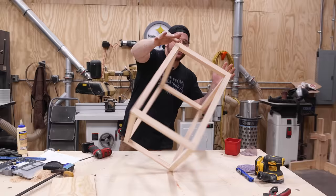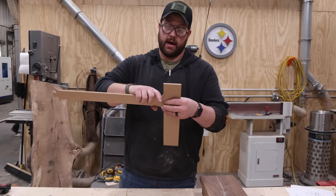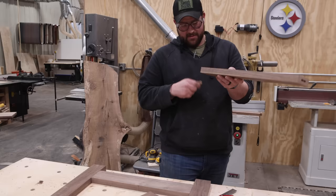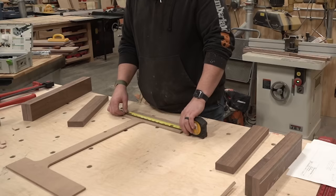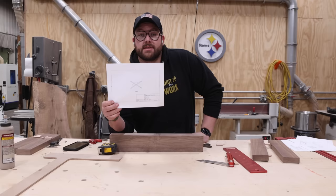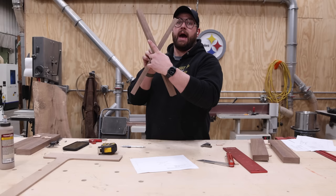For my base I'm going to be milling down some stock and then building the two parts using a template cut on the CNC. If you're looking to build this yourself we'll provide the template in the plan — we need to make two of these. To make it more complex, we're going to do a 65-degree angle. I've got everything marked out; we're doing lap joints that will look something like this when done. We've got to cut these before we shape them, so I've got one shot.